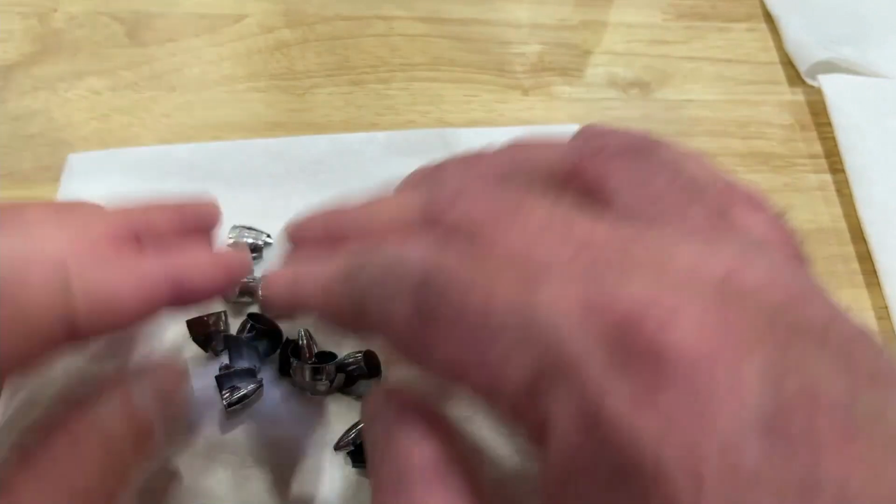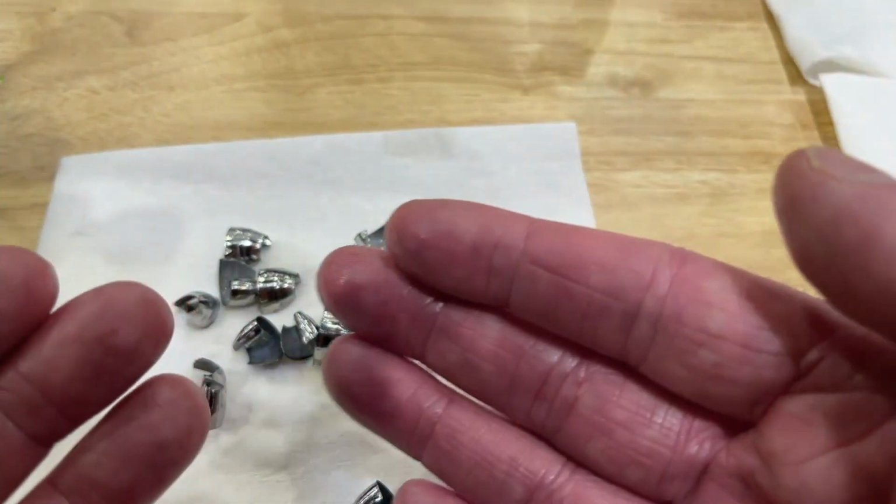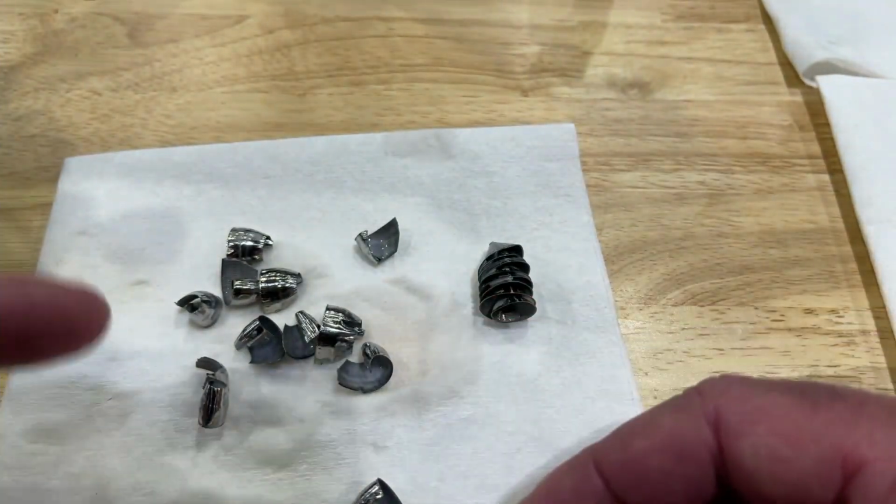Okay, but then on my outboard, you can see I get a really nice chip on the outside because on the periphery, what it's going to have is positive cutting geometry out there to get the chip to form better.